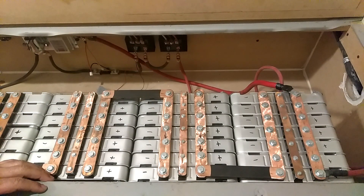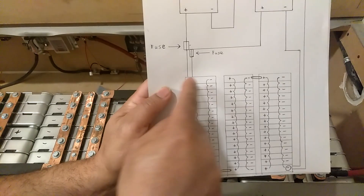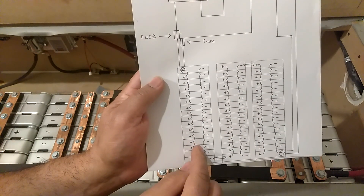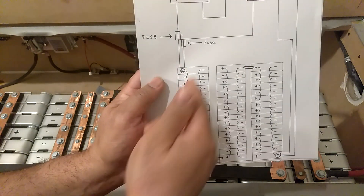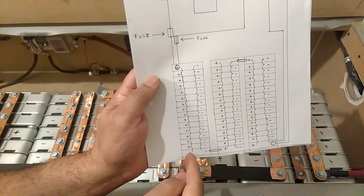Basically that's how I do mine. There are other ways, but this is the best way I think to do it. This right here is you putting your bus bars on and tying all of these batteries together. You're going to have 16 batteries in each stack. Once you get your 16 batteries in each stack, you're going to make your bus bars to go all the way from one end to the other of each battery stack, then make your cross bars.